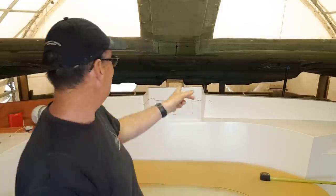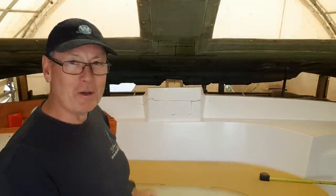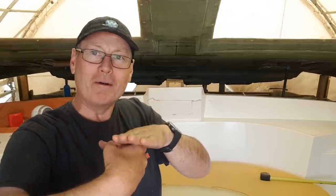I've come to the centrepiece of the build — the mast and how it's going to integrate with the module, the deck, the window mullion, and a whole range of other areas. Remembering that I have 30mm foam under me here, unlike the 8mm of solid glass of the original craft. The mast is a deck-step mast, so it actually sits directly on the deck. In most catamarans it doesn't transfer through the deck — it sits on a solid post, bulkhead, or mast post underneath.